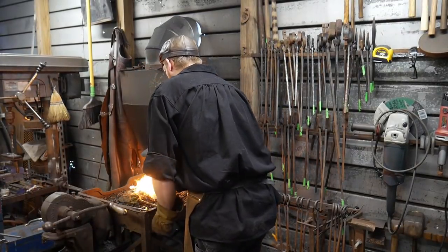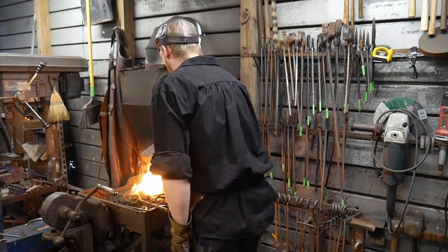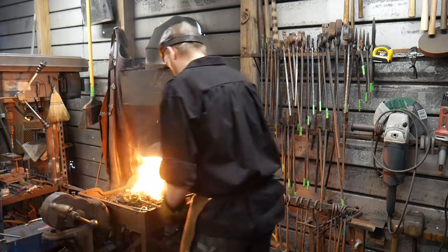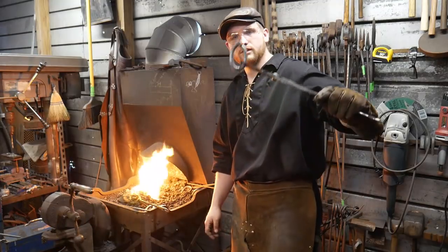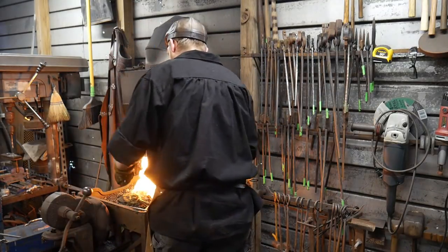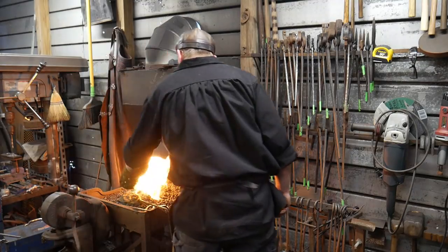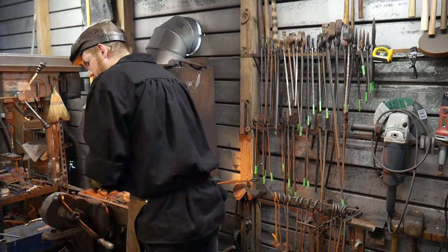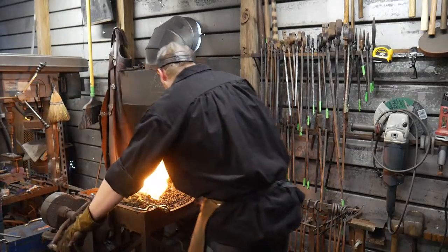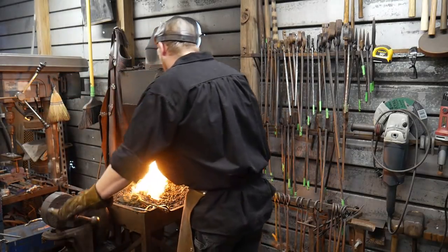Shinnick says, are you pre-forming the links prior to welding? Yeah, you have to form the links prior to weld. I've got two others sitting over here I did earlier, waiting to go in. And predominantly after you pull out one and get it welded, you go right to the next, and one would be heating while you're going on to the next.